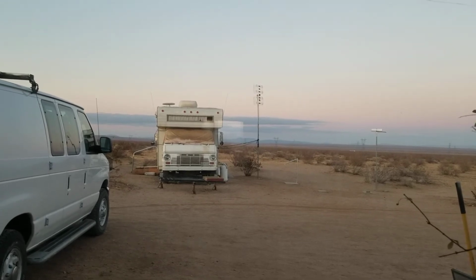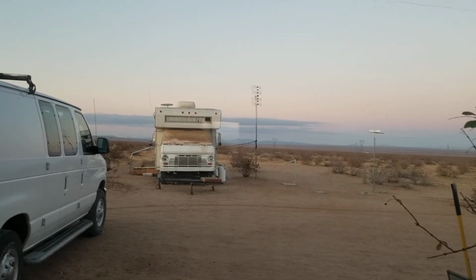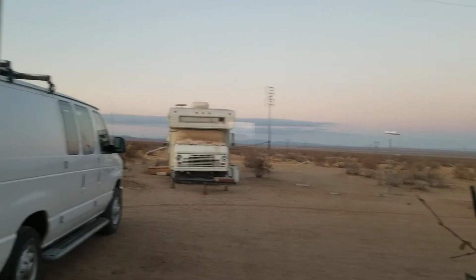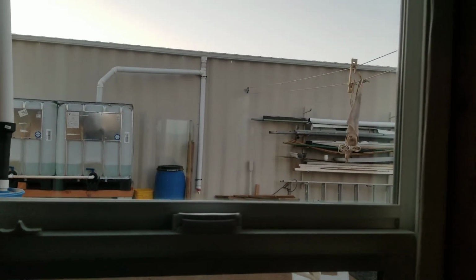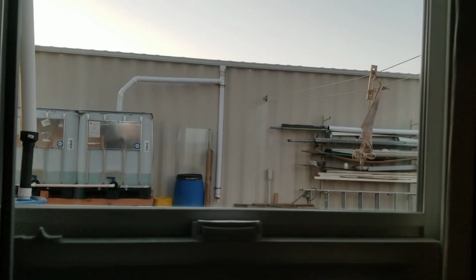And hopefully I'll get some rain, and we'll see how my rain catchment system works and how my first flush out there against the container works. With that I'm supposed to be able to get over 600 gallons of water in a 1-inch rain off the roof that I've got there. And I only have two 250-gallon totes there. So I might end up having to run a garden hose off of those and run it down to the garden house and fill the ones up down at the garden house to lower these down if we get more than 1 inch of rain.